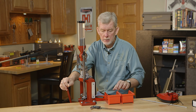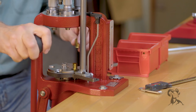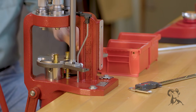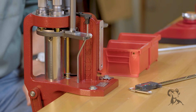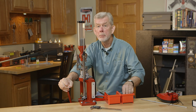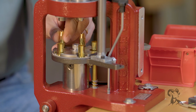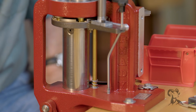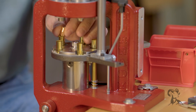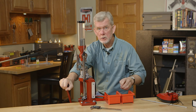So it's that easy. Once you get going, here's how it works: seat the primer, put in another case — first case is charged. Put in another case — second case is charged. So from this point on, we need to grab a case and a bullet with each cycle of the handle to keep the chain of events flowing. Case is in place; as the charged case comes up, put a bullet in it, seat it, another case, another bullet. Repeat as needed — you can load as many or as few rounds as you like this way.